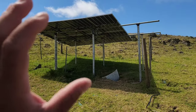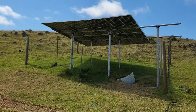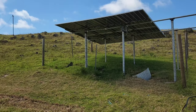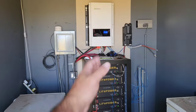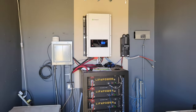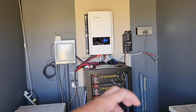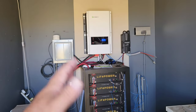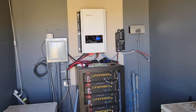I've seen a huge difference — I'm not telling you to go buy bifacial panels, but I personally have seen a difference and I love it. I'm getting way more power out of the system and the batteries stay charged faster and longer. The way the Growatt inverter works is that once the batteries are fully charged, it has a pass-through function where power from the solar panels is converted live directly into usable power in the home, not even touching the battery bank unless we're pulling more power than the panels are producing.